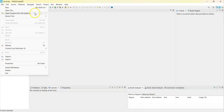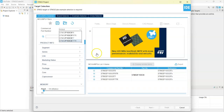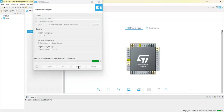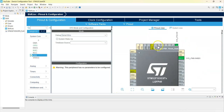Let's click File > New > STM32 Project. For the commercial part number we put F103C8 — that's for the Blue Pill. Click Next, then I name it 'shift' and click Finish. We click System Core, set SYS debug to Serial Wire, then zoom in and make these three pins GPIO output: PB6, PB8, and PB9.